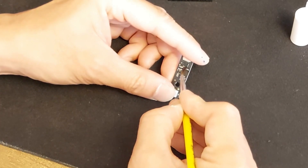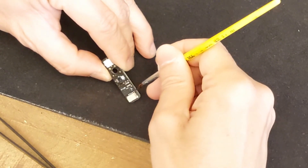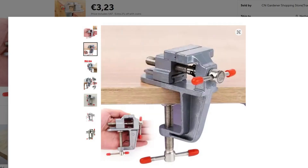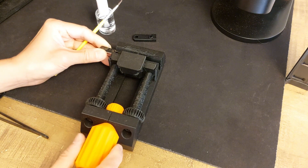For the time of flight sensor, it's a simple installation. I just want to highlight that you will need nail polish to conformally coat the board, and you will need a small brush to apply it. The brush that comes with the nail polish product is for nails — it's too thick — so it's not easy to apply, and you cannot apply it over the whole board; you need to preserve at least the LED and the sensor. A thin brush makes it easy. If you don't want to end up with nail polish on your fingers, you may improvise — buy a small vise from AliExpress or print one. I'll leave a link in the description. You can also improvise with some hanging clothes clips. It's not mandatory.